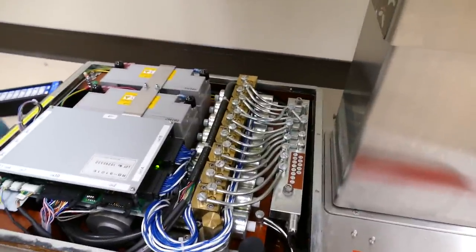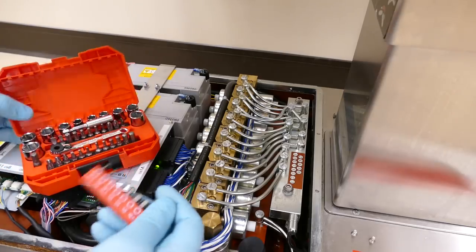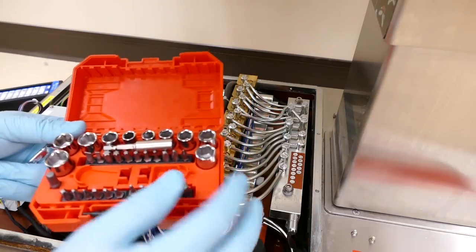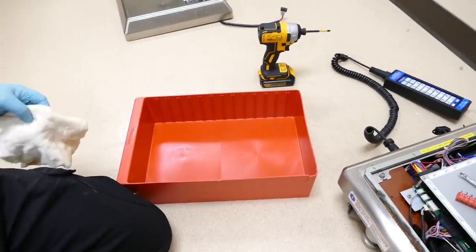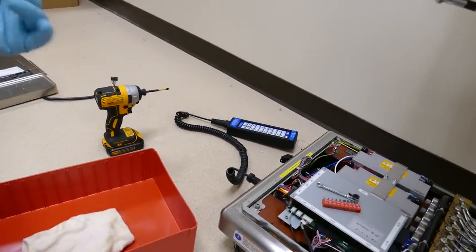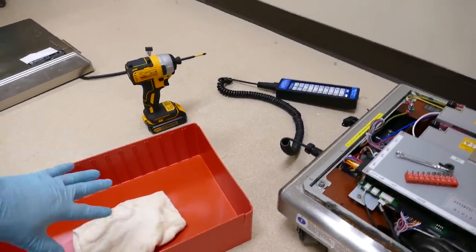For these surgical tables I like using this little Craftsman kit — I also bought a metric Allen set to go along with it. This Craftsman set has a little offset wrench and a whole collection of different sockets and bits. You're going to need a couple of rags because this will make a mess. I also highly suggest using a plastic container because we're going to disassemble components from the block and place them in there — we'll have tiny stainless steel balls, springs, and needle valves that we need to keep in a clean environment.